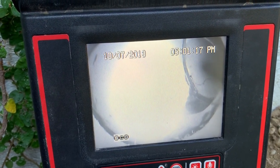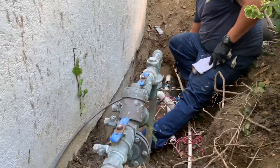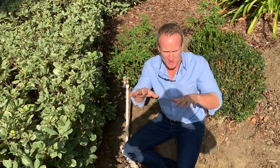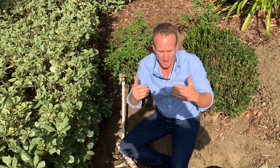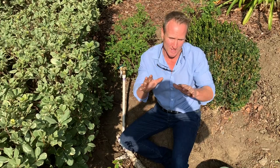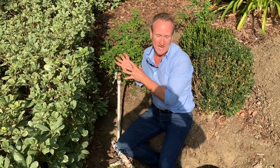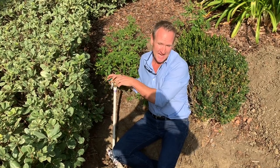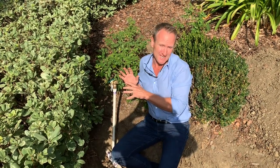With the T-fitting located, we'll excavate that specific area to install a proper isolation valve. A great tip: use a sewer camera inserted into the pipe to find out where those underground PVC lines run. We've run the camera and determined it's this side of the property. The camera also helped us map where the underground water system runs. We've identified an area and installed a hose bib right here — this gives us access to pump our safe gas into this section.